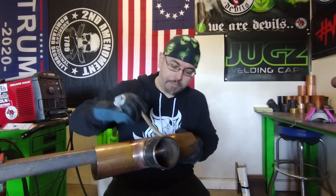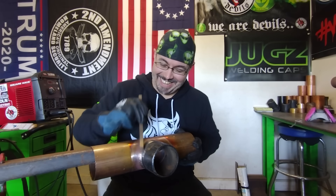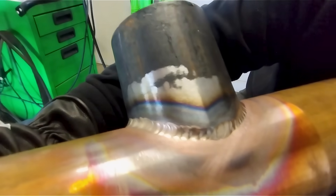Now I don't typically do a lot of downhill welding, but in order to get this shot, I did downhill welding. I do not recommend doing a lot of downhill using these two materials. Make sure you give your pipe a good cleaning. As you can see, I have no cracks, no holes. It doesn't have to be pretty — you're going to cap it anyway.